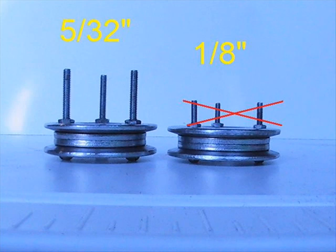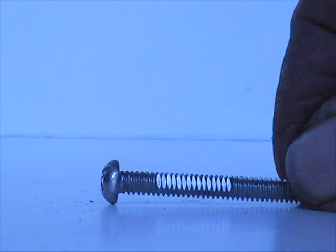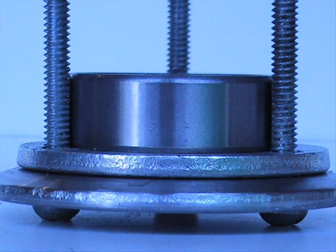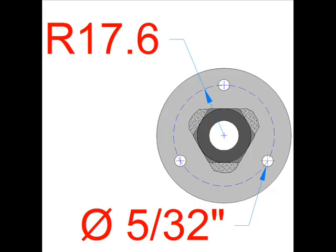The reason for this change was due to the threads resting against the bearing — the tips of the threads would be squashed, resulting in a loose instead of a firm fit against the bearing to hold the flanges true. By using a slightly larger bolt and filing off that portion of the thread that comes in contact with the bearing, this problem has been solved. For the location of the holes in the drilling jig, you can use these dimensions for a fairly accurate guide.